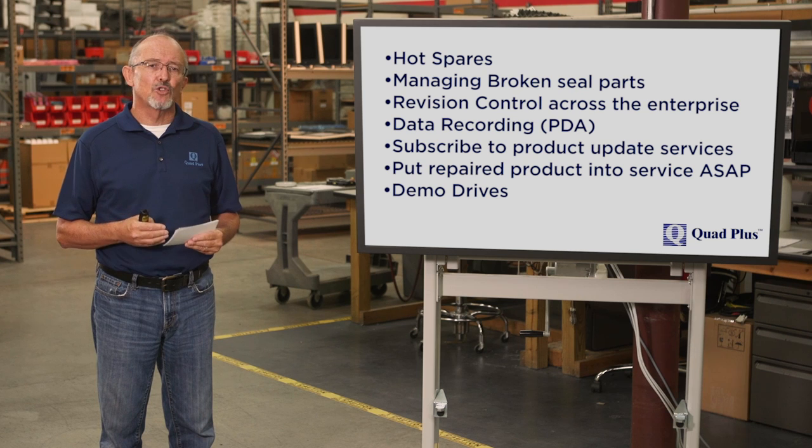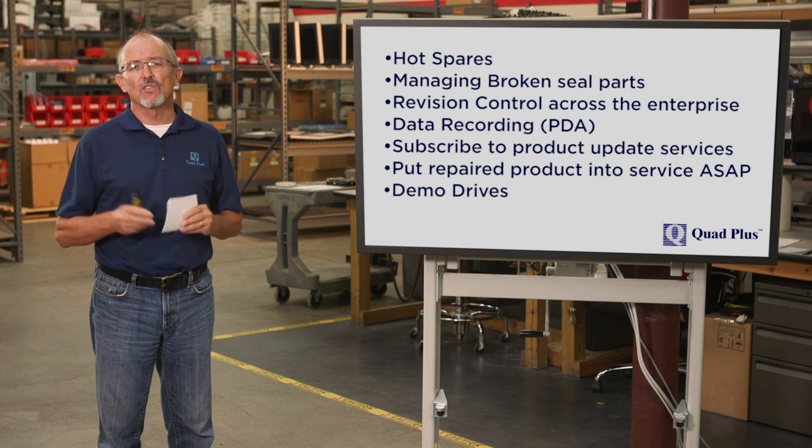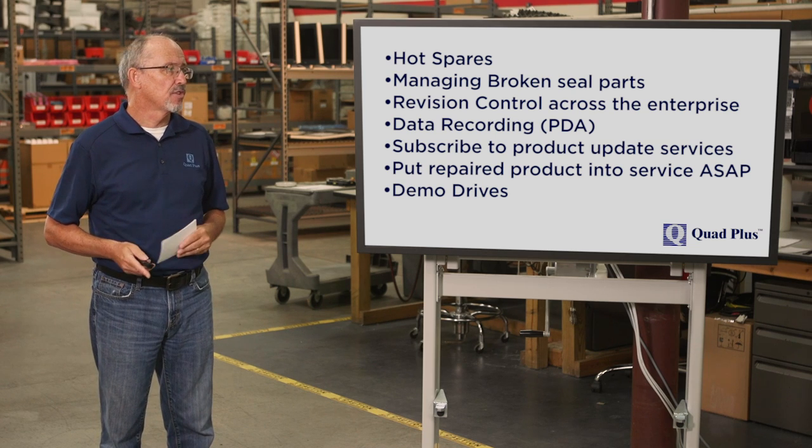Demo drives, a great thing to negotiate at the final end of a purchase. If you have a demo drive sitting in your shop, there are a number of advantages. Number one, you keep your people trained. They can do things on the demo drive without interfering with production. You can also test option boards and smaller components, and verify parameter setups. So that's another great idea. Those are the main process items that I've seen. Of course, there's a lot more, but those are the things I've highlighted for this video.